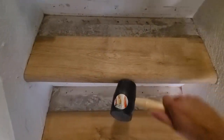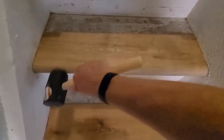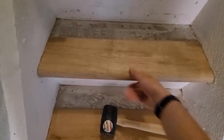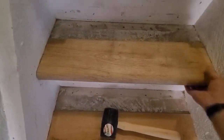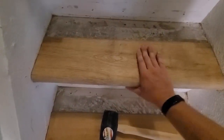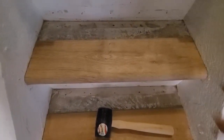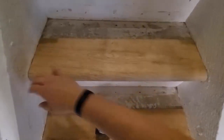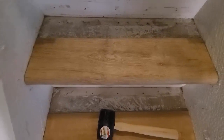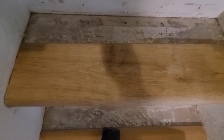If it's a little snug, I use a rubber mallet to make sure it's evenly in the right place. It shifts around a little but eventually you'll find the sweet spot — you can feel underneath to see where it might be a little off. For the most part it's pretty much a perfect fit. I've got a little bit of space on the sides where I'll put some caulking, but it's otherwise a very close fit.